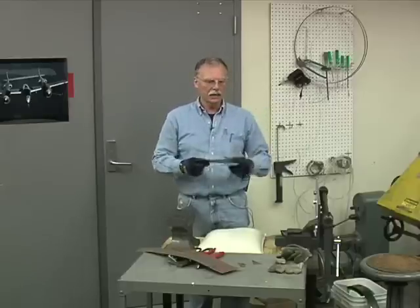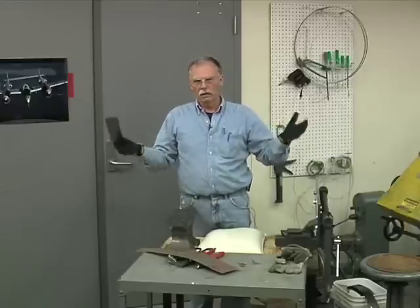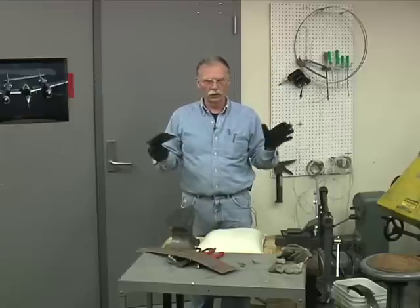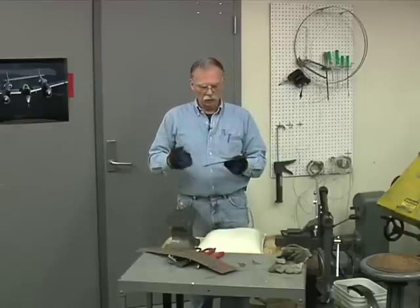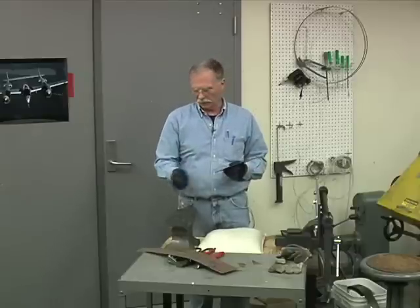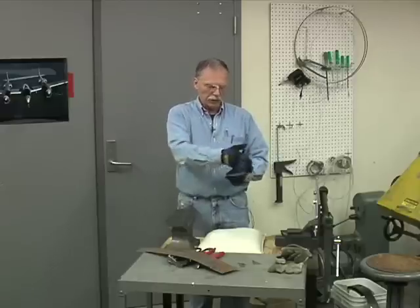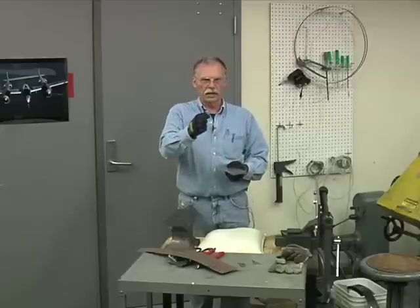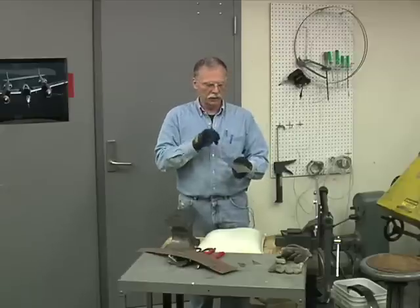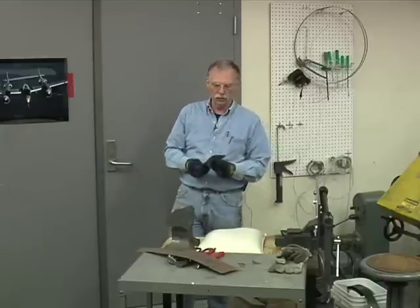For larger pieces, larger panels to fit a body or cover a hole or make a box, you want nice straight edges. You don't want stop, start if you can help it. Stop, start is fine for little plates and covers, but you can cut long pieces, and you'll tend to have a wavy line. It's best to do it with a piece of shop equipment to give you the longest possible seamless cut.